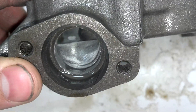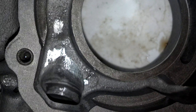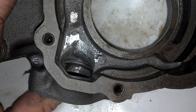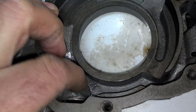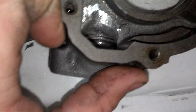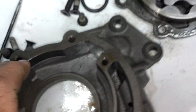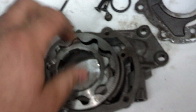I'm not sure if we did this or the customer did, but it's still a good example of what you want to do. You don't even have to polish it. This one could be radiused a little bit more, but it gives you an idea — you want to radius the inlet so there are no sharp turns or corners, and radius the outlet. That's pretty much it.